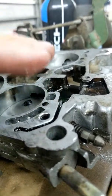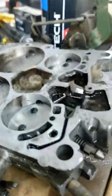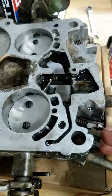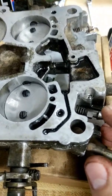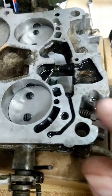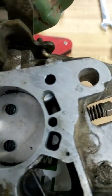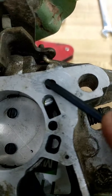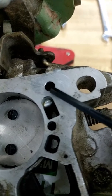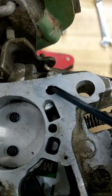If you're going to do this, I would recommend taking it slow and using a good clean bit. Do it by hand — I'm using a drill but I've done this a lot so I know how to feel the bite. If you're doing this for the first time, do it by hand. Use 1/4-28 set screws. The bit is sharp enough that it'll start cutting from size without pre-drilling. Take it real slow, back out, use some lubricant.